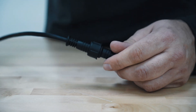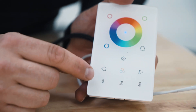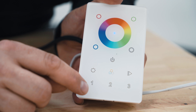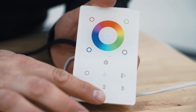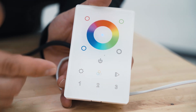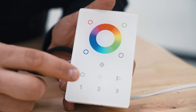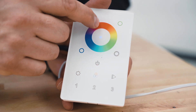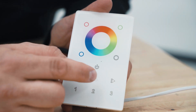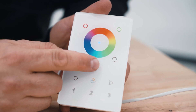We already have this set to address 001, which is going to line up to address 01 and zone one on the controller. These zones correspond to addresses — zone one is address one, zone two starts at address five, and zone three starts at address nine. We have videos covering all the features of this controller — please check those in the description. Now that we have it hooked up and we're on zone one, when we turn the dial we're changing colors on the wall washer. You can press the button to turn all channels on, and turn everything off by pressing the power button.